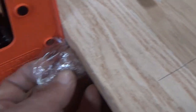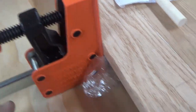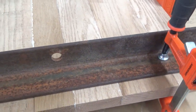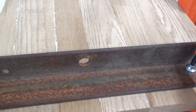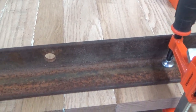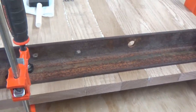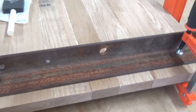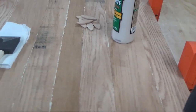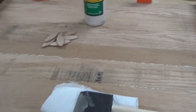I got some dollar store plastic wrap and I put it on top of the bars of the horizontal clamps just to keep them clean and keep the glue off. What I really like about the steel angle iron is the glue doesn't adhere to it, so when it's time to take this apart — I normally wait 24 hours — it'll come off with just a tap of a hammer, no residue, no sanding needed. You can also use scrap pieces of wood with plastic wrap between your workpiece and your clamping piece.